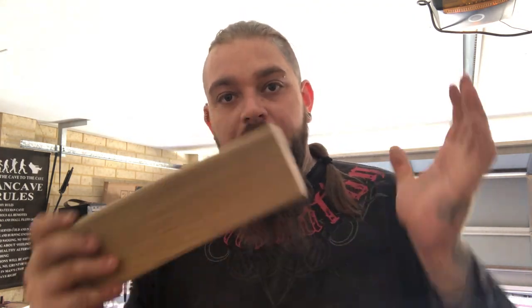Now I don't want to put a whole heap of resin in this that I'm just going to have to cut out later. So we're going to make a bit of a resin saver out of this piece of pine - stick it in the middle so that we're just wasting pine and not cutting away resin.